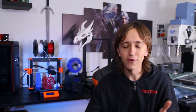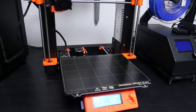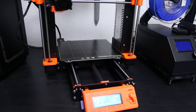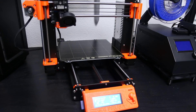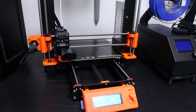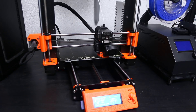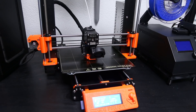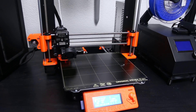Now let's talk about some of the smart features. As already mentioned, the motors know when you're running into the end stops — that's how they calibrate. In the beginning of the print, the first couple of times it's a bit surprising: it just basically rams into the side a couple of times to get a good sense of where the zero point is. There is also bed leveling that it does before every print, which is really fast and uses the probe rather than just the motor — which is a bit more precise and also means you don't have to ram the hotend into the build plate every time.